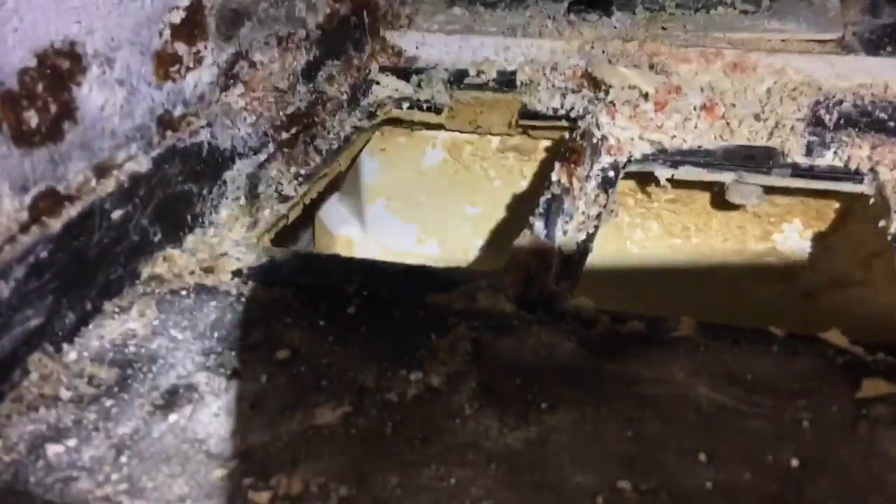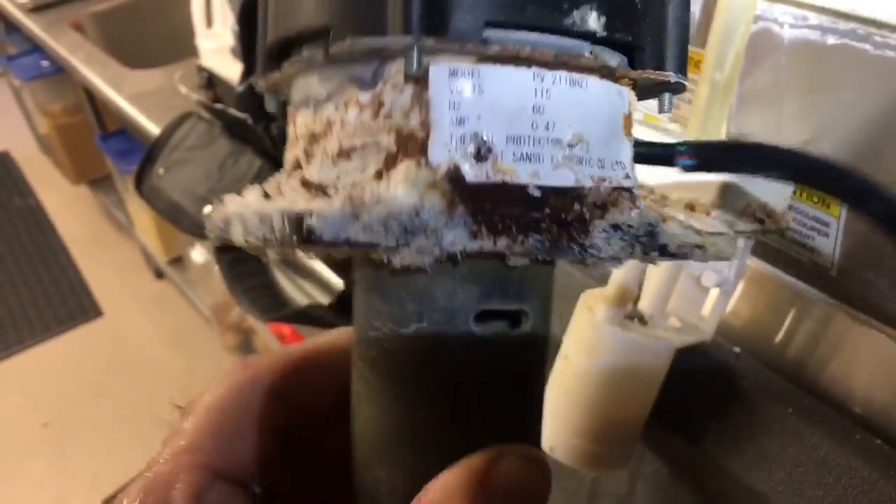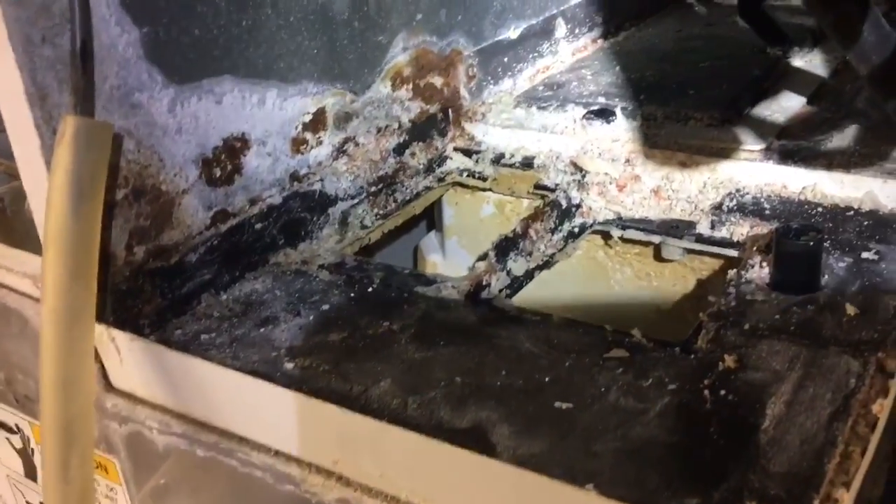So then get your water pump out. There's one thumb screw — that black thumb screw right there. Goes in the front and then the back. Pulls out after you take your water tube off. But that's the old crusty water pump right there. And then we're going to get that whole plate out of there next — get the plate removed.